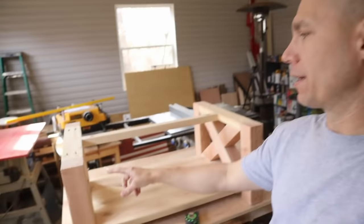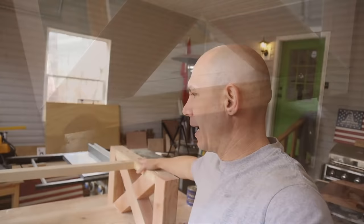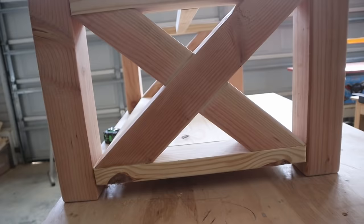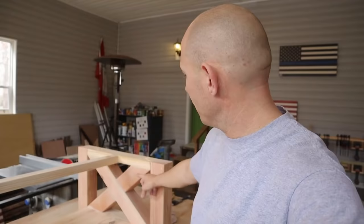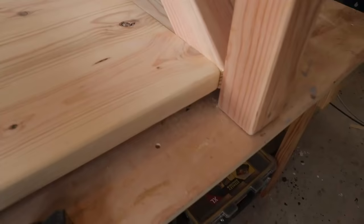I'm building this base for a four-foot long by three-foot wide coffee table with breadboard ends, built out of two by eights cut in three equal parts to fit between each post. I pocket hole screwed them into that four by four on the bottom, and used a two by two on top for a brace to keep everything square. The tabletop's going to have tabletop fasteners — it won't be fastened rigidly. These are somebody else's plans; I'm building it because the customer wanted it. I changed mine up a little — I used two by fours instead of four by fours so the X's don't look cramped. Pocket hole everything. I'm going to try doweling the breadboard ends.